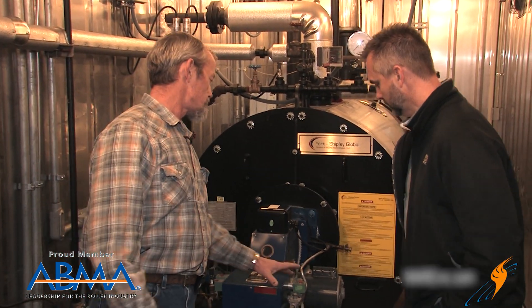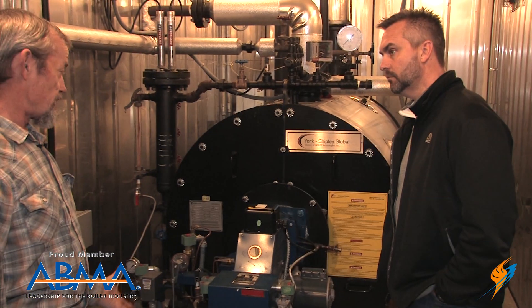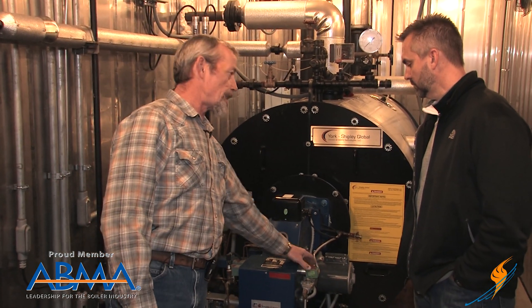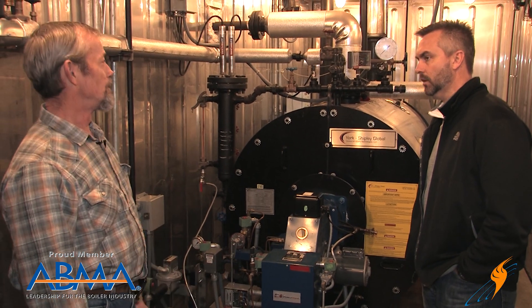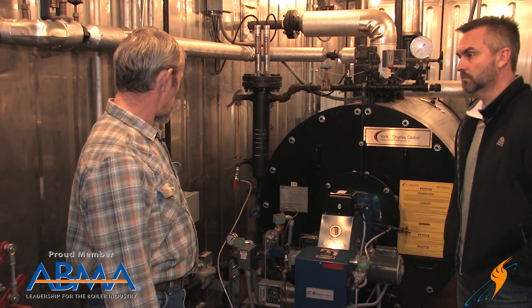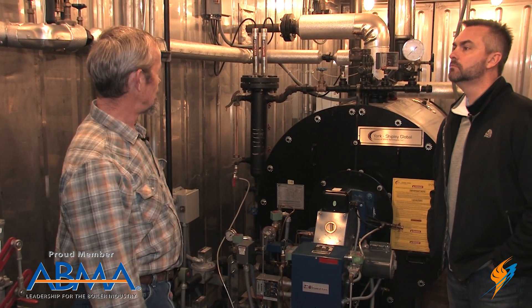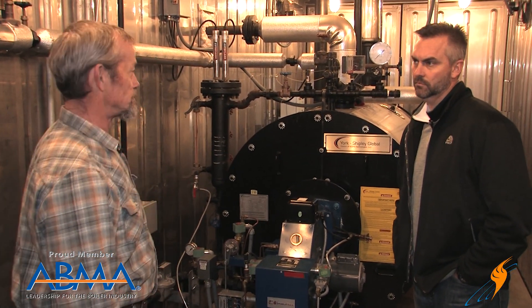As far as the pilot, the only time you can check it is when the actual boiler is starting up — that's when the pilot will energize when it's lighting. But it's always a solenoid valve, so you can listen to it; you can hear it actually make and break. And if you have meters, that's probably a good time to check what's going on — when the valve closes down, you can look at your meter and make sure it's stopped, because the gas stopped going through it.